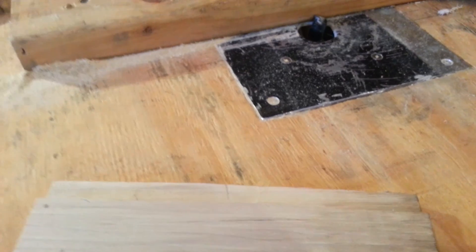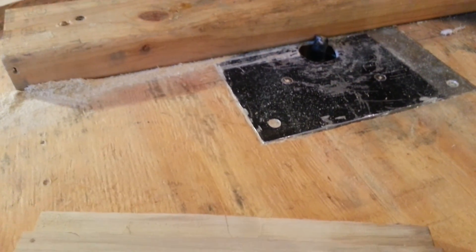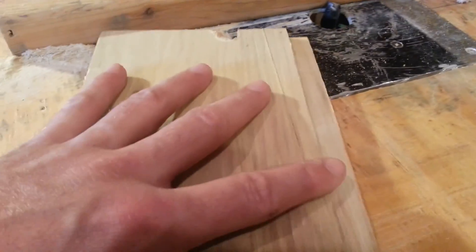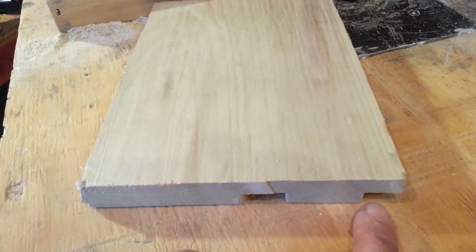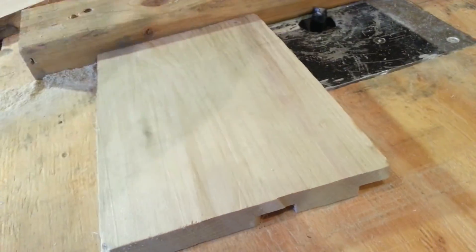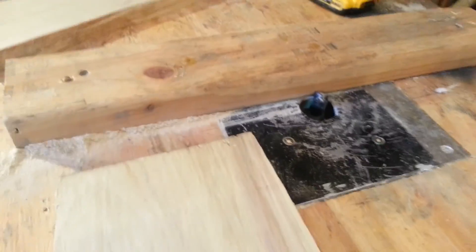You can use a table saw — I have a dado blade for my saw but I really don't like it; it chips the wood a bit more than I like. Before I built this router table, I would just use a table saw: set the blade for three-eighths depth, same as this, set a fence up for the right measurements — from your fence to the outside of your blade would be three-quarters of an inch — run them all through, bump it over a little bit, run it through again, and then I'd end up chiseling all that out. But the router table is quick, painless, and effective — that's the best way I've found to do these.